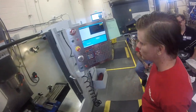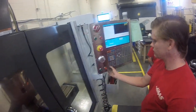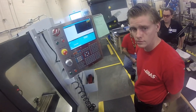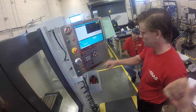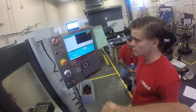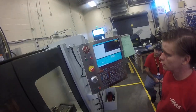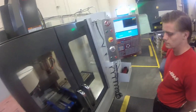Do we know what RPM it's running? Hit the clockwise button — it's not even turning on, it does have no RPM. It might have been running all day and this thing goes 6,000 RPM, so if it's clockwise it's going to run whatever RPM it ran. So let's put in the RPM you would run on the Bridgeport manual mill — 750. And which direction? That's right, which would be M3. Here's a program, cycle start to run the program. Now it's running with no edge finder.